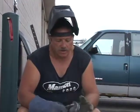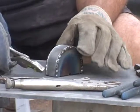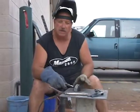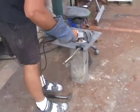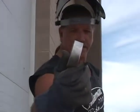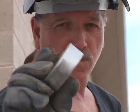It's all welded up, ready to attach to the fender — attach halfway, making it look like it's ripping out. I'm going to do the rips next after I grind this. I'll get this all smoothed out, and after that process is done, I'll start doing the rips for the fender which will make it look like it's actually ripping out. I'll weld those, curl them and get them into the forms and shapes, then attach this whole unit to the fender and do the webbing afterwards. There it is — one steel hockey puck. Now if you used these in the rink, you guys would have less teeth and maybe more concussions, but we'll let them use the rubber ones. We'll use this one for the fender.